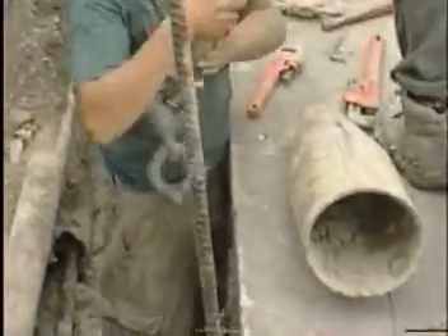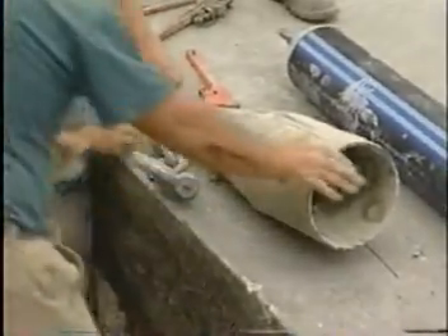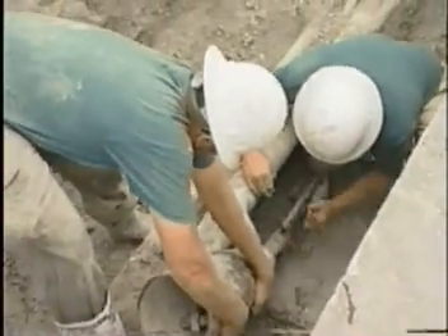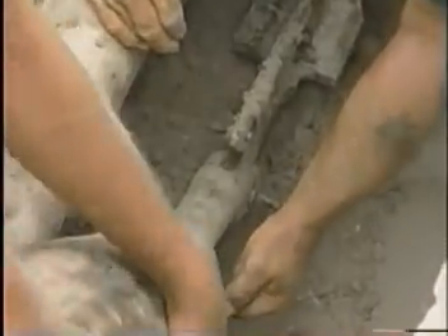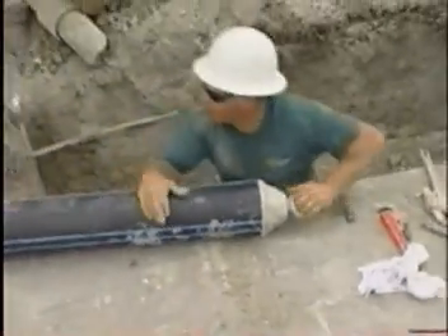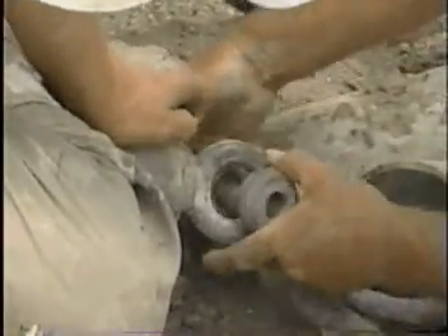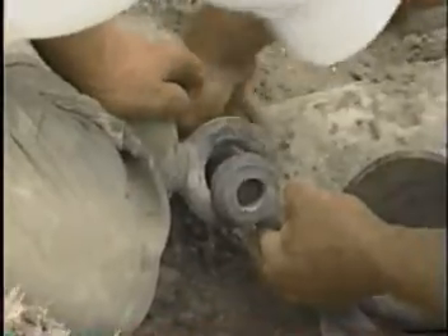What we're going to do now is attach the expander to the splitting head. On the back of the expander you'll see our rod with our shackles, which will then hook to the HDPE pipe, which is already pre-chlorinated. Once we have all this hooked up, we'll start bursting and pulling back. To attach the expander, we just hook it to the back of the splitting head and the pin goes through and anchors it in place — a simple, easy, quick method. At the end of the pipe we have the pulling eye, which is an expanding eye. It inserts inside the pipe and we turn it out on the fins, which locks the pulling eye into the pipe. That is what attaches to the back of the expander. Once it's in position, the shackle is screwed into the pulling eye and the pipe is then ready to be burst.